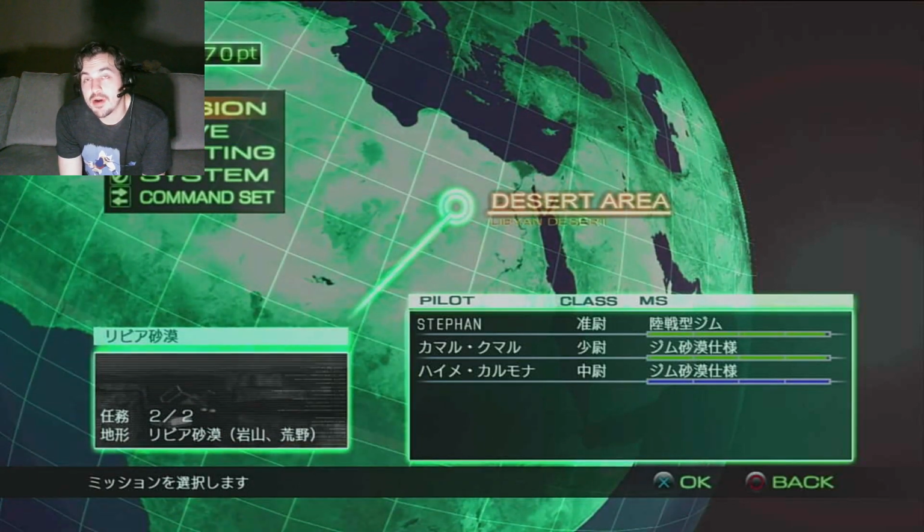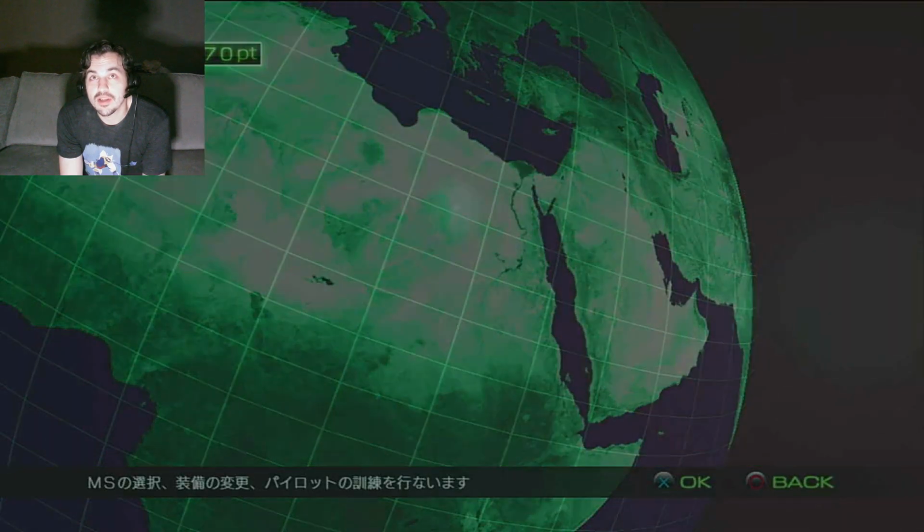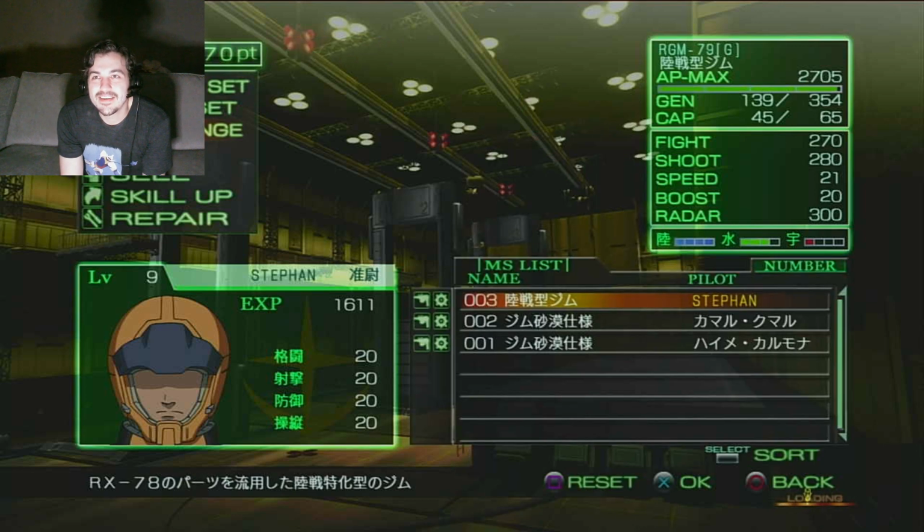Oh, one thing I probably should have mentioned about the silicone molds that we've got curing there is heat and moisture will speed up the curing process. So if it looks like I'm sweating my face off, it's because the air conditioning is off. I figured that the heat would help the silicone cure, and we can cut those guys open faster. All right.